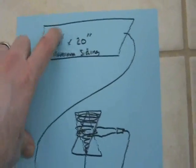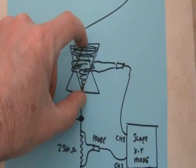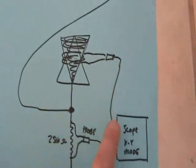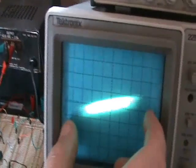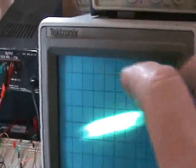I've worked out something that gives a little better results. If you connect the plate antenna to the bottom of the coil with nothing attached to the top — so the coil is also receiving incoming energy — and you connect these two together across a 250k ohm load, then looking at them in XY mode with one channel being the magnetic component and the other the voltage across the resistor, the results are pretty good. There's a nice wide amplitude on X and decent Y as well. Every once in a while you see a pop-up and it stays larger — the energetics change based on reception.